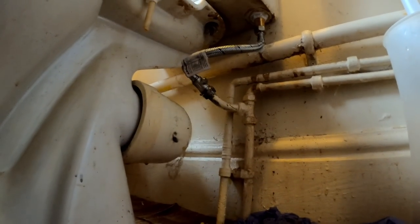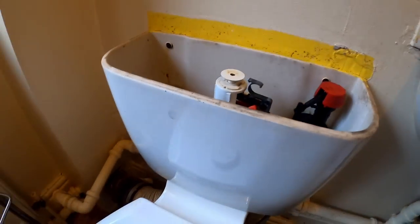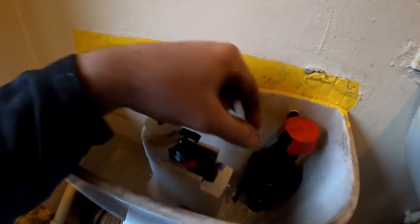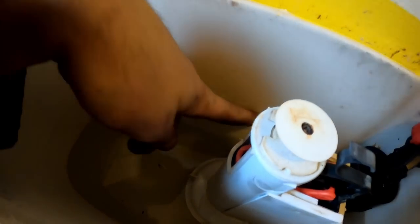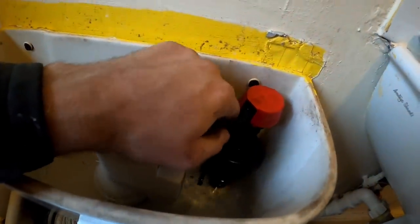That's what it is. We've just got the water back onto this. We'll make sure it all turns off. Make sure the toilet doesn't overflow inside, because sometimes when flush washers can cause it, but I think it should be good. We'll obviously set the water line to, it's actually down there on these, you see it's been getting too high. So that 6 litre line is there. But obviously we just adjust it on the float.